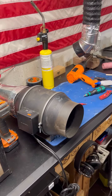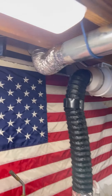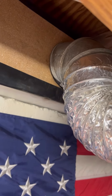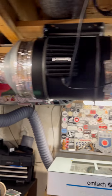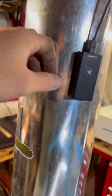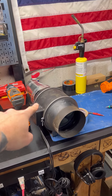I've been using this 6-inch for the last few years and it's been fine. But I figured maybe I should upgrade one of these days and see if it works. So I got the box in place — you can see that it fits nice and tight around that frame. I got my connector in that hole. You see how it has to wrap around that beam there, which is kind of a pain. I'm going to turn this on — I'm only going to turn it on to halfway, because halfway is the same power as the full power of the 6-inch.